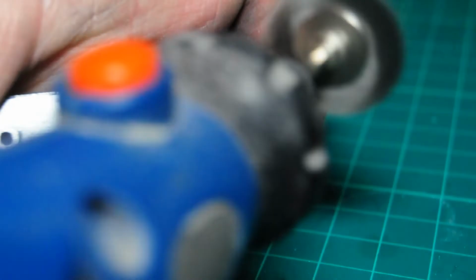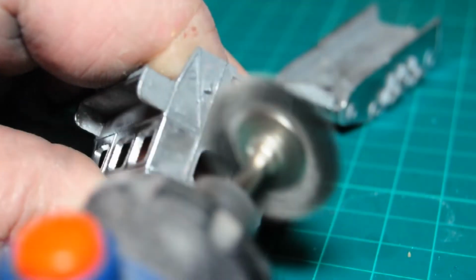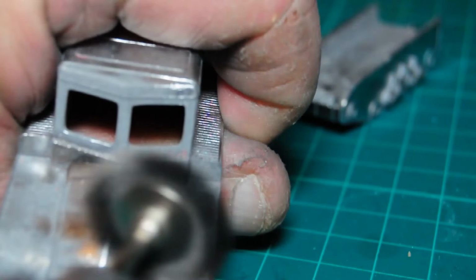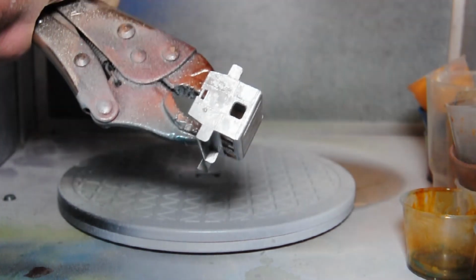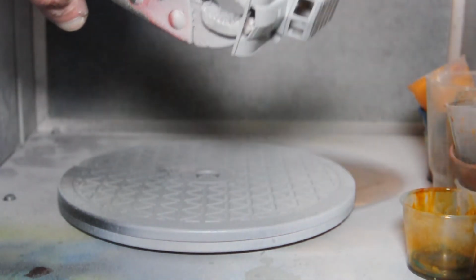Anyway, here I've got the wire wool. I'm taking the oxidisation, etc. off the casting, cleaning it, ready for paint. And it's quite good really. And as I'm doing it as factory, I'm not even bothering looking for casting seam lines and filing them out, because they wouldn't have done that at the factory.